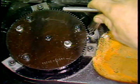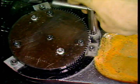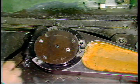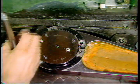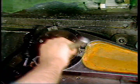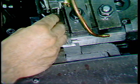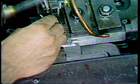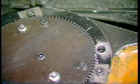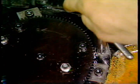Use a tool called a timing wrench to turn the eccentric. Turn the eccentric in the appropriate direction, then tighten the draw bolt. Check die match again and continue to adjust die match until the grooves which are formed are perfectly aligned.